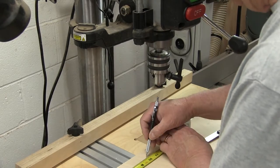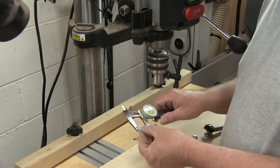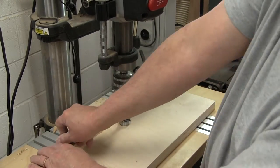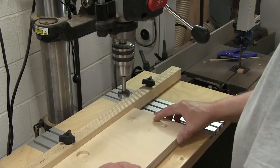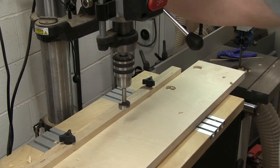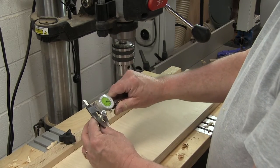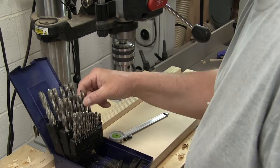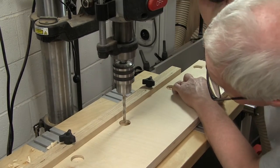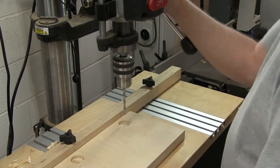Taking it over to the drill press. We've got to cut 4 holes, so I'm marking the position of those 4 holes and lining them up with a square. We need to countersink the washers, so I've got a Forstner bit there. We're going to hold the board down with the bit and set the fence against the bit — that's the easiest way — then set the depth stop on this bit so we can easily punch these 4 countersinks in. This is a 5/16 inch bolt, so I'm going with a 5/16 inch drill and a quarter inch drill for the lag bolts on the ends. So we're going to drill our 5/16 inch bolt holes in the middle too, then change out and drill the quarter inch holes for the lag bolts on the ends.